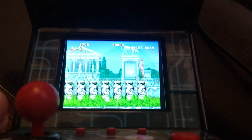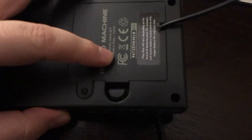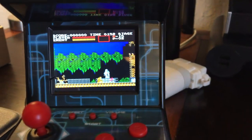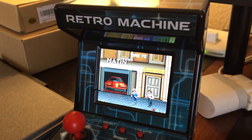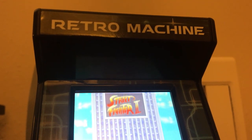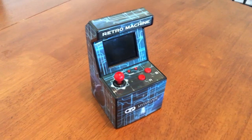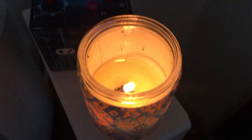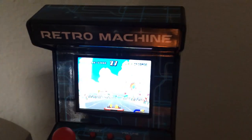Finally, I stuck it all back inside the arcade case with some double-sided tape to align the screen, cut a small hole in the battery compartment for the USB power lead, and hey presto — a custom mini arcade cabinet that plays classic arcade attract mode screens when it's powered on. It's accessible over WiFi to change settings and add more videos over time, and if I choose to go even deeper, I could install real arcade games via emulators and play them with a Bluetooth gamepad, but that's a project for another day. The next step will be to peel off these ugly decal stickers and print my own custom arcade cab overlays. Thanks very much for watching — check out the product links in the description below.